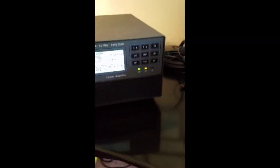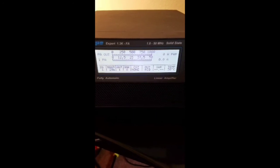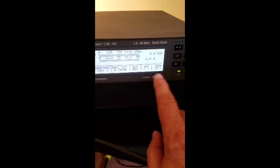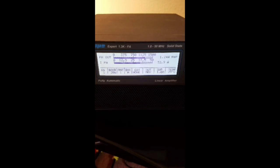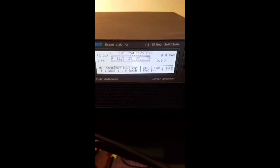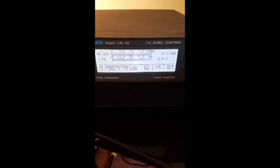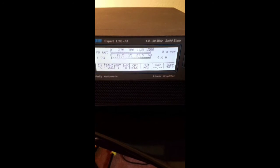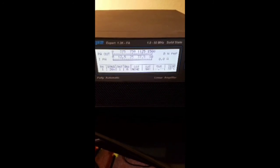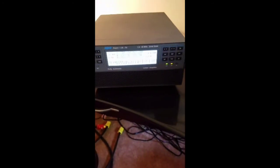So now let's go to operate and turn on the exciter. We get 1.1 kilowatt — great, isn't that fabulous? Let's go to higher rail potential — we have a 1,500-watt max. Turn it on and we're getting 1.2 kilowatts, and with only 14 watts of drive, so there's lots of headroom. There is a slight inefficiency through the linear amplifier — we lose about 0.8 to 1 dB through the ATU, which is perfectly acceptable. The unit is fabulous in terms of its form factor, its size, and with the ATU built in. As you can see by this initial test, it really performs fabulously. The workmanship is excellent, and I would recommend the unit.